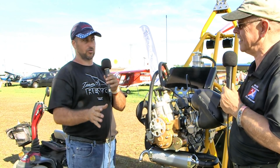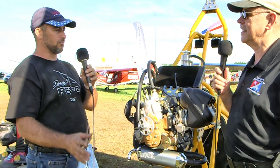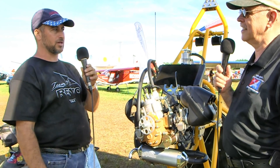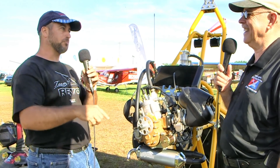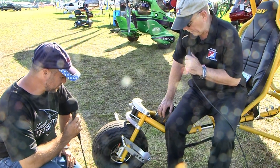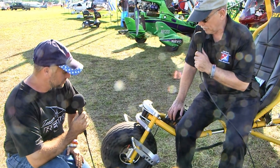We have quite a braking system — something new. I was talking with the designer at Freebird Innovations, or Black Max, and he said they've got this super stol braking system: two brakes built into a single caliper, four brake pads on one disc. I wound up combining it with a Matco master cylinder with an intensifier kit, which increases the hydraulic pressure it puts out by sixty percent.